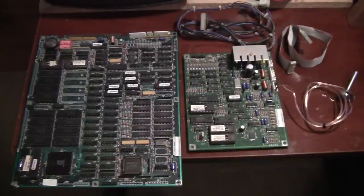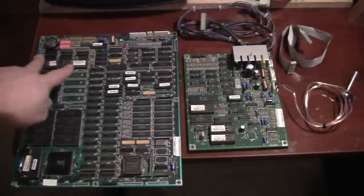For the first video, we have Mortal Kombat — I'll refer to it from now on as MK1. When MK1 was first released in 1992, the hardware used to support the game was known as the Y-Unit. This is the Y-Unit setup of Mortal Kombat 1. This hardware was used for the prototype revisions all the way up to revision 4.0. This particular board is revision 4.0. The way you can tell what revision these games are is on the revision ROMs, right here.